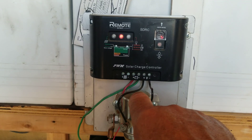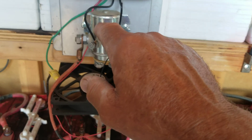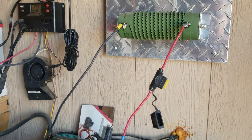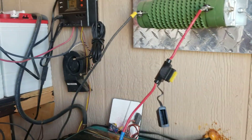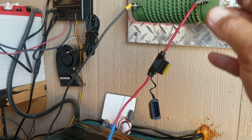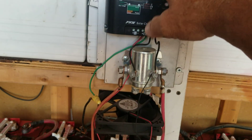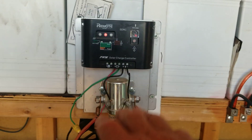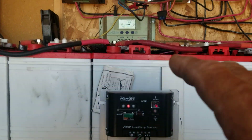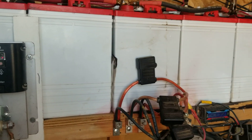The reason I have a fuse in line going to my heating element is for the dump load. A dump load takes any extra power that might slip past my controllers before it hurts my batteries — it clicks on and sends that extra electricity to a heating element to dissipate into the air. Later, that's going to go to my solar water heater. For a small system like North's, he doesn't need a dump load controller, a heating element, or fuses and cutoff switches all over the place.